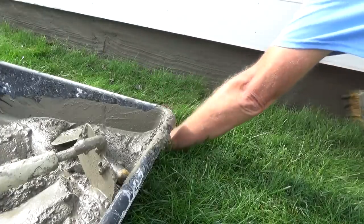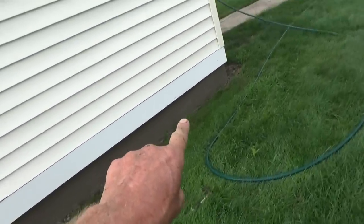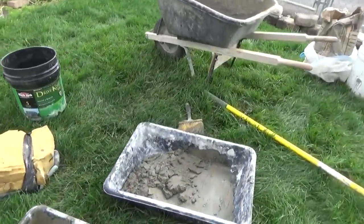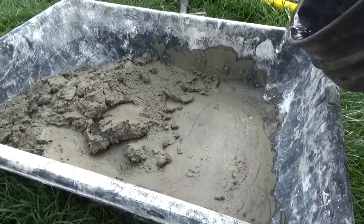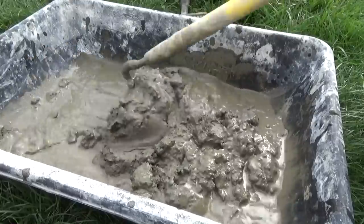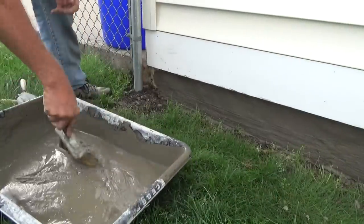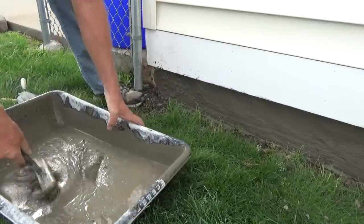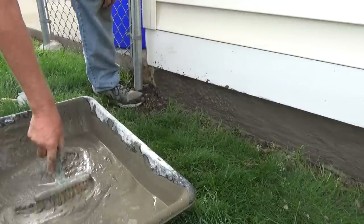So now we've plastered and brushed it from point to point — the idea is not to stop, and it only took us about ten minutes. Now we can start splashing it. This is the old school way. Come over here, this is the hard stuff, and then we're gonna really soup it up — we're gonna make what they call a splash, really wet. Then we get our stucco brush and splash it on. See? No big deal. The whole trick is to go and stop so it splashes on. Practice on a piece of plywood first.